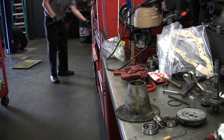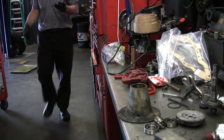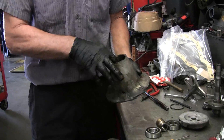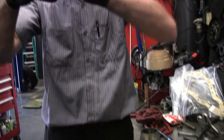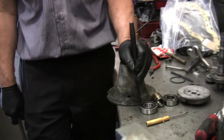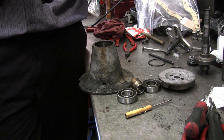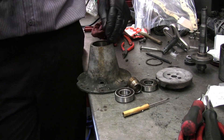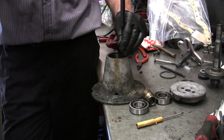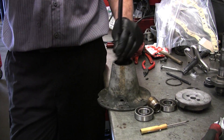Now I'm putting that first bearing in — make it a long steel drift. When you tap on bearings, this inner bearing has to fit on an outer housing, so don't hit the center with the hammer — hit on the outside edge. Because if you're hitting in the center, you're going to damage the ball bearings inside. I walk back and forth, kind of like that torquing pattern, that star pattern, and I'm walking it down.